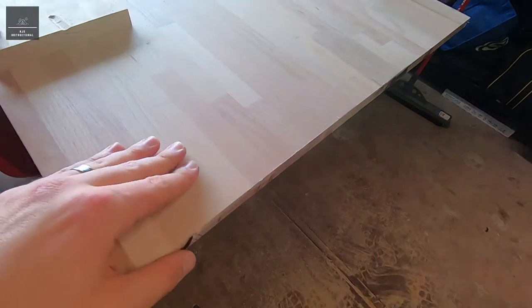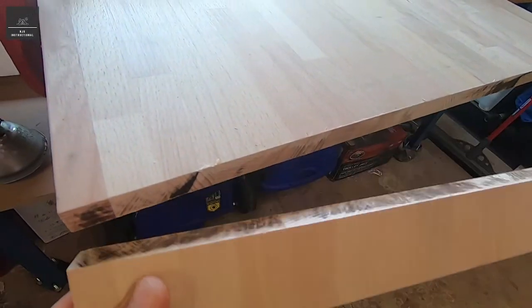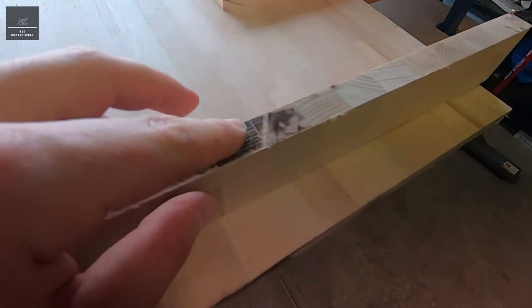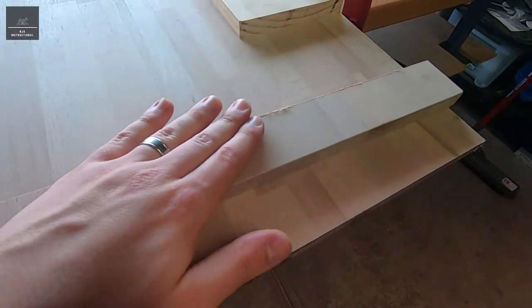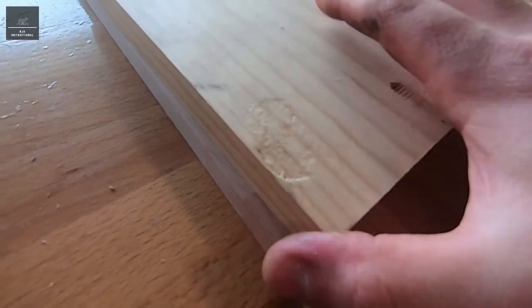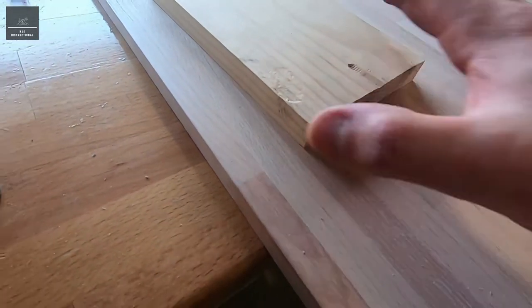So that's all the cutting done. We've got our nice straight edge — roughly 600 by 800 — and we've got our locking piece of timber. I'll position it flat like that, which will be easier to screw in and we won't risk splitting the timber. You can see the impression the G-clamp has left on the spare timber, whereas on the actual good timber, because we spread the pressure, there are no marks. A handy hint there for you.